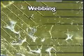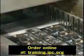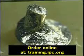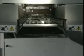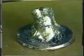Bridging and webbing are most frequently related to a rough solder wave, incorrect wave height, or the solder temperature being too low. In addition, these defects can also be caused by improper fluxing or incorrect conveyor speed. When the solder fillet appears rough, dull, and grainy, discolored or contains cracks, it is almost always related to solder composition or contamination. Time and temperature of the solder wave contact can also negatively affect the appearance of the solder joint. In addition, make sure that assemblies are not bumping or shaking on the conveyor after the assembly leaves the wave. If this occurs before the solder becomes solid, the joint will appear disturbed.